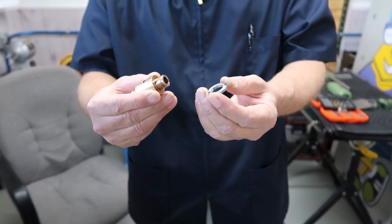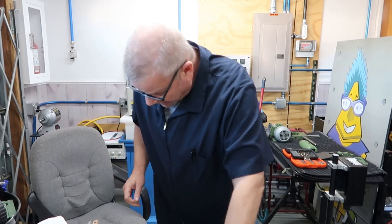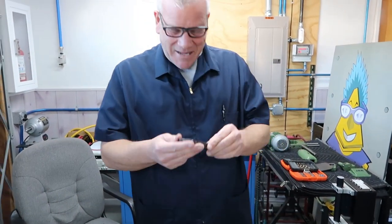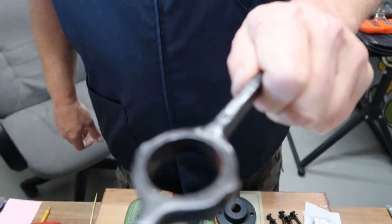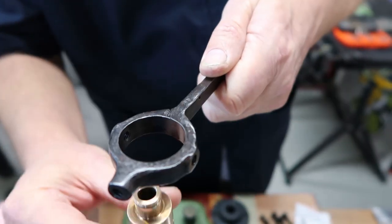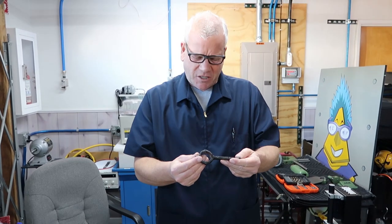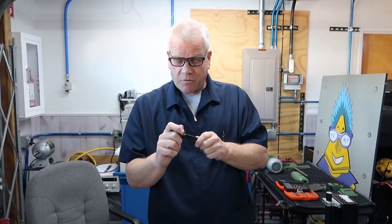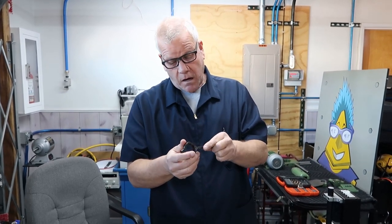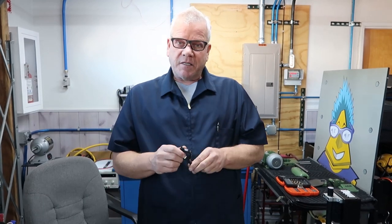Patrick is going to make two new bearing nuts. And saving the best for last — the tapping head lever, which was green when we first saw it sitting between the two bearings. It's a cast part, crudely made but tough. I cleaned it up really well, gave it a cold bluing treatment, and I'm going with that black finish. This is a refurbish, not a rebuild, so no paint — but we kind of love this black finish and think it'll last longer. It cleaned up really well and will look even nicer when assembled. We're very close — just make the nuts and we start reassembly.